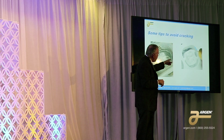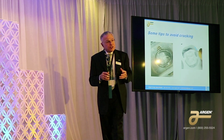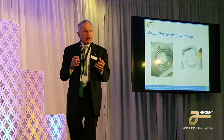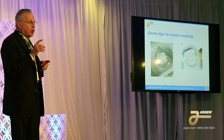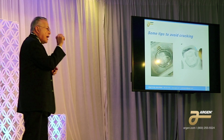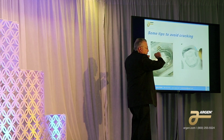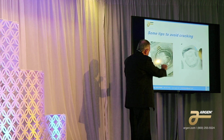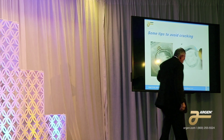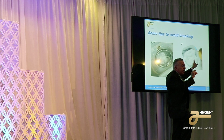When you're removing the units from the disk, most people use a high-speed carbide, and that's fine. But a high-speed carbide generates a tremendous amount of vibration. So when you do remove the units, make sure that carbide tip is not next to the unit, but as far away from the unit as you can get. Cut next to the support and guide the carbide through — don't push it through.